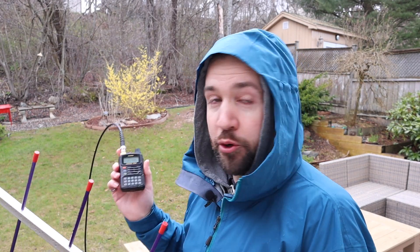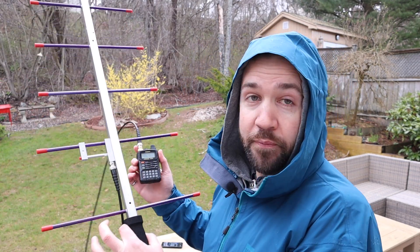The goal from here is to do the same thing I've just done, but with my own software — tuned instead of to amateur radio satellites, tuned to the SpaceX Starlink constellation. First I'm going to try with this antenna on a motorized mount so it will do the tracking automatically. Then we'll prove we can do that tracking, and use the other radio to automatically adjust the frequency to track the Doppler based on the position and velocity of the satellite relative to us. The final step will be swapping out this antenna and receiver for equipment that can receive on the Starlink frequency bands, and hopefully get a similar signal from the Starlink satellites.